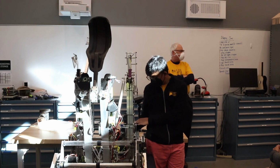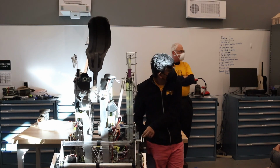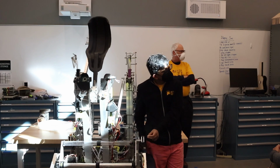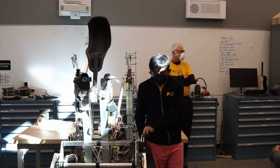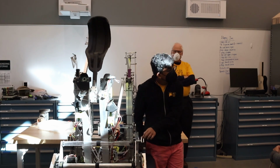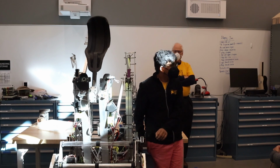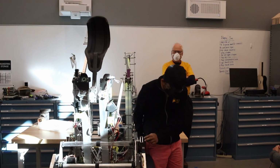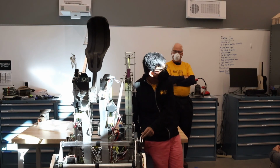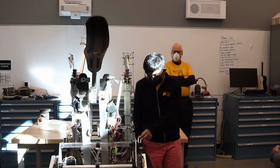Yeah, that makes sense. And then with the potentiometer, I think they can still do the same thing in that in the event that the potentiometer wire breaks, do they look at that connection in your analog input and say that's an open circuit and therefore stop? Due to the way the Rio works, I believe it just floats. It doesn't actually bring it high or low in the case of a wire failure. Also, the case here wasn't a wire failure, the pot was disconnected entirely. We're still not entirely sure how that happened. In the same match, the top half of one of our optical encoders also just disappeared. That's one of the unsolved mysteries of this robot.